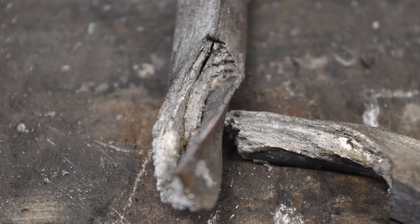Now, in some later forms of Viking swords, there's interrupted twists that twist one way then the other, and they match up very, very well. So it's safe to presume that they might have been very aware of the fact that the pattern did exist at some point. But I have a theory that early on, they actually purchased or traded for these steel bars and they came pre-twisted. Now, anybody who has any experience in working with homemade steel, such as bloom steel, knows that a great way to test your steel is to draw it out into a bar and twist it. And if there's no shearing or cracking, you have made very quality steel or iron.